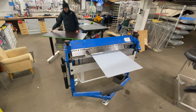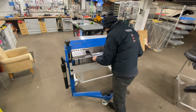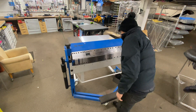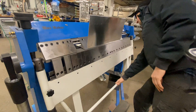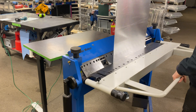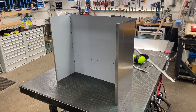I take the big sheet, put it inside, and I've got this height-adjustable workbench which is really nice because I can use it as an outfeed table for any of my tools. I adjust it so the end doesn't flop down. Now I can align it properly, clamp it down - make sure your thumbs are not underneath the teeth, that really hurts, I did it a few times. You just have to figure out where to align your bend lines to get the bend at the right size, and you can do it really quickly once you put some time into the setup.